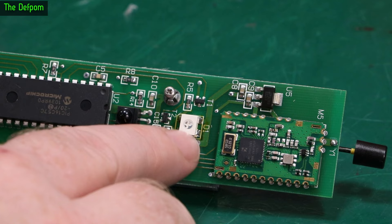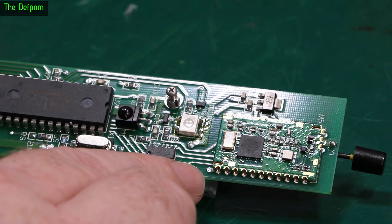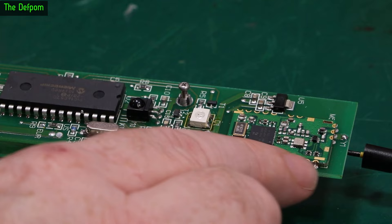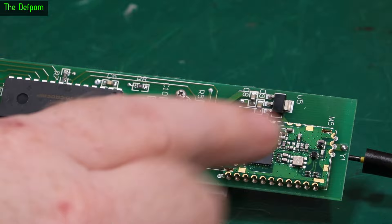It's got four wires coming up which obviously go to this module, and also got the voltage regulator section here which also goes to this module. So it looks like it's got two supplies — maybe that's zero volts there and that's five volts or three volts, whatever it is. So we've got these connections which go up, and obviously that's some other supply line down there. It could be something with these lines, but it's most likely to do with the castellations and the soldering onto the circuit board. It could still be an issue on this board itself — you know, bad solder joints on that IC. It could have been impacted and shaken around, and there are obviously castellations up here as well. That was my first thought — a bad castellation connection.